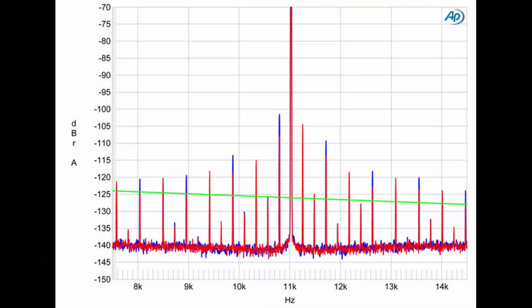The third thing that you ideally want from a digital signal transmission is low levels of jitter. This is problems with the timing of the information itself. It's been shown that levels of jitter can adversely affect the operation of a DAC in objective, quantifiable, measurable ways.